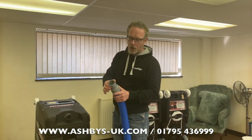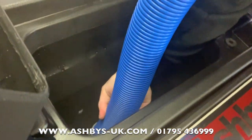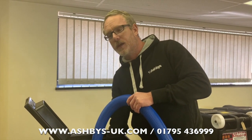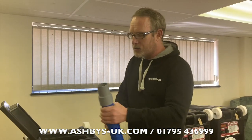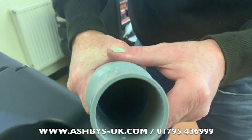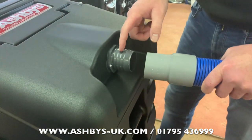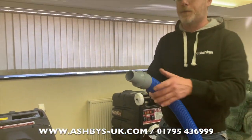I'm going to put the hose cuff into the warm water in the solution tank for about 10 seconds. That warms it up and makes it supple so you can push it on easily. If you're getting it out of a cold vehicle, the cuffs can become stiff and brittle and can rip. Always check that hose cuffs are screwed on properly — the blue fitting should be seated nicely. Just turn it a little to check; don't over-tighten. Remember it's a push-fit, not a screw-fit.